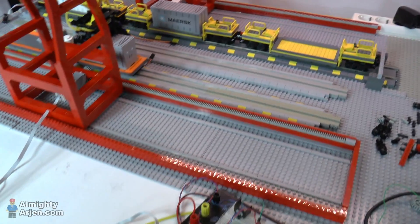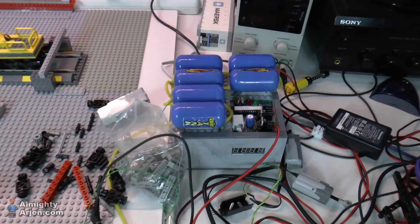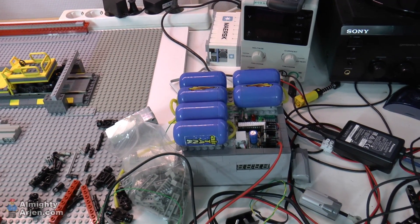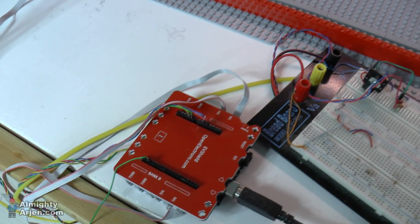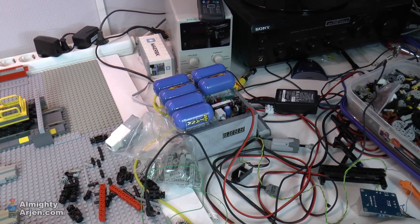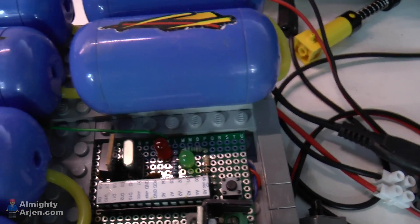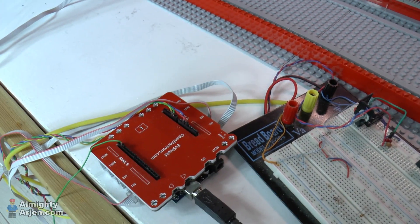There's also a green wire that runs from the motor control center to the compressor — or actually the other way around. It carries a signal from the compressor indicating that the pressure is stable and high enough for the unit to function. So when the system boots it waits until that signal is okay — it's just a digital line that goes high when pressure is sufficient. I also installed a little green LED in there; a quick-and-dirty fix but it works just fine.